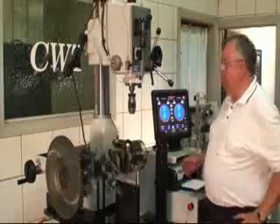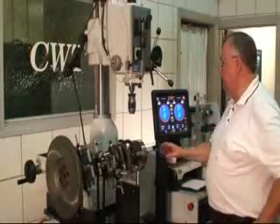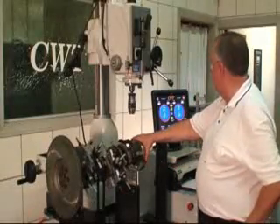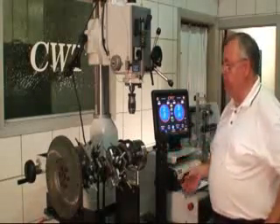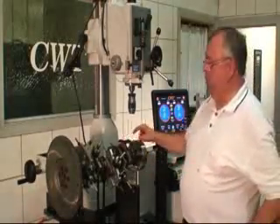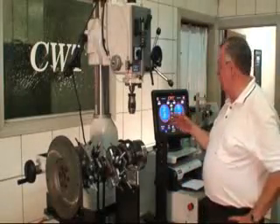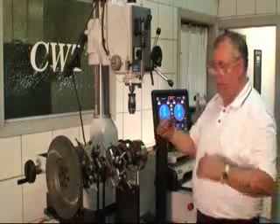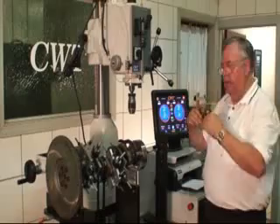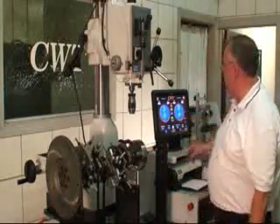On the left side we've got 13.6 grams, and on the right side we still have 19 grams to go. But you'll notice when I come back up to TDC, it's right in position. I purposely short drilled. What was different? On this one I didn't use DPC. On the other side I did use DPC — so I had less material come out because I only removed the minimal amount due to the drill point angle. But at this point, both sides now have a drill point, so I can trust these numbers.